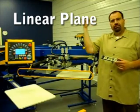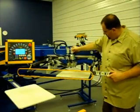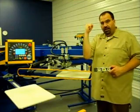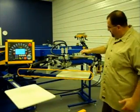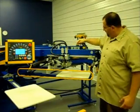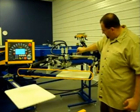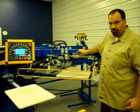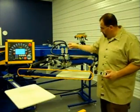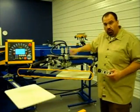Okay, now that we have a plumb shaft with our level, obviously each head runs on the same linear path as each other in relation to the main shaft. So obviously the head itself should be level to the shaft. Now we look at that with steel tubing. We pick other horizontal lines on the machine to make sure everything is level. We'll also run through some different checks to assure that we have true linear passage back and forth on the head. So we'll move to that next.